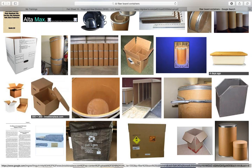Okay. In addition to that, also, we want to stack lumber on level, solid, supported sills. And we have to remember to remove all the nails, right? We want to stack pipes neatly, and we want to chock them, right, so that they can't roll. Look at figure 3 on your right-hand side on page 5. That's a perfect example there. They're basically chocking it, right, or blocking it there. And it's basically so pipes can't keep on rolling out. And then that way they can start stacking them in pyramids, okay? And, of course, we want to taper in every time we do that. We're not going to have an option but to taper in, so that'll kind of work out for us anyway, okay?